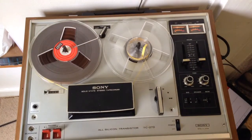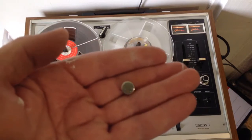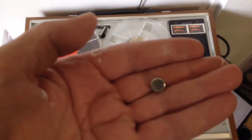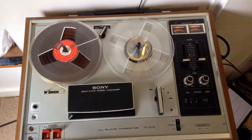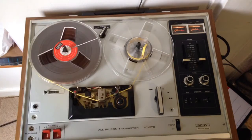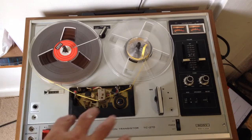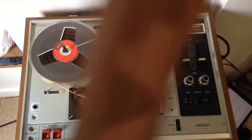What I really wanted was a bulk eraser, and they are fabulously expensive — but what isn't at all expensive is these rare earth magnets. This one looks to me like probably about three-eighths of an inch, certainly over a quarter inch, and it's quarter inch tape that we want to blank with it. I thought maybe I could find a way of putting it temporarily into the tape path here in the transport, so I could wind a tape over it and it would blank the tape as it went. But I decided against that — there's nowhere I could mount it where it wouldn't be much too close to the heads, and I don't know what effects it would have on them. So instead I decided to add a bit to the tape path that you would actually hold in your hand, and I'll show you how it goes as we go along.